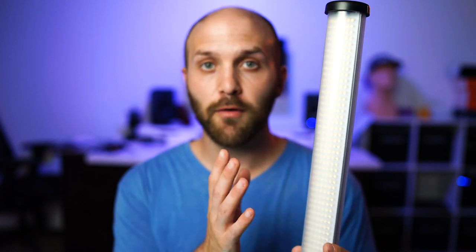You can see on it there are 256 LEDs, but once you turn it on you can't really see the LEDs because it goes through a diffused plastic to try to make it more like one light source. There's actually a whole other 256 on the opposite side. So what Godox did, instead of mixing this and having a bi-color single panel of LEDs, you have two completely separate panels of both color temperatures — daylight balance on one side and tungsten balance on the other — and more LEDs of one color has a big benefit when it comes to power, which is something that these LEDs typically lack.